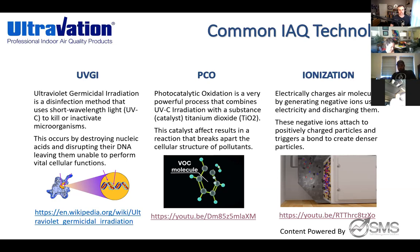PCO and ionization are also important to clarify. A lot of products have PCO. As far as ASHRAE standards go, they don't really get into that granular level — they care more about UVGI at the base level. PCO, or photocatalytic oxidation, is only possible if you have a surface area treated with titanium dioxide. A UV lamp activates it and creates a reaction field — the photocatalytic oxidation — which helps break down airborne DNA, live particulates, VOC molecules, and provides deodorization.